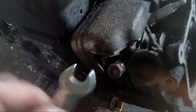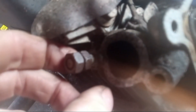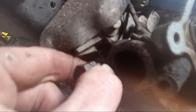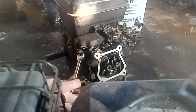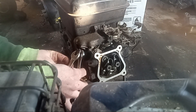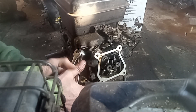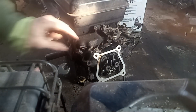Now we're going to take our second nut and thread it on there. The idea is to make sure this nut butts up against the other one. This one is actually a half inch. We want to get it down a bit more — that should work. Now we're going to take our bottom one and start loosening it so that it butts up against the top one. Now take two wrenches — put one on the bottom nut and the other on the top nut. Hold your bottom wrench so that the other nut spins while you tighten your top one. Now these are pretty tight together.